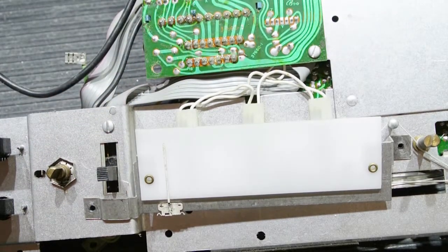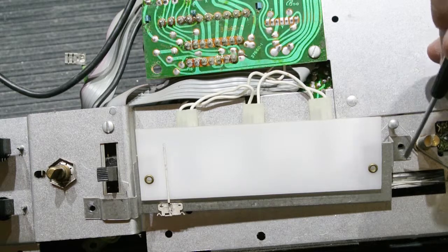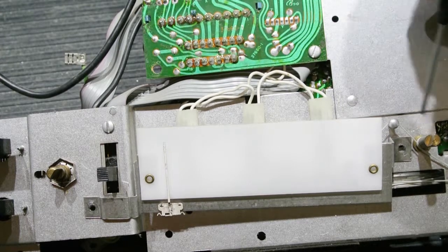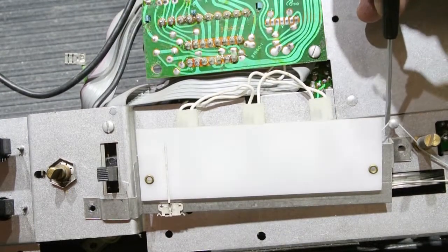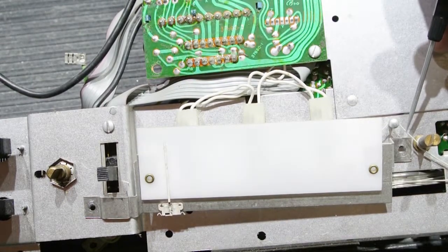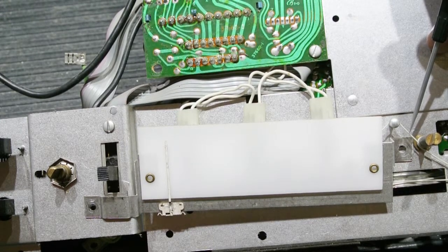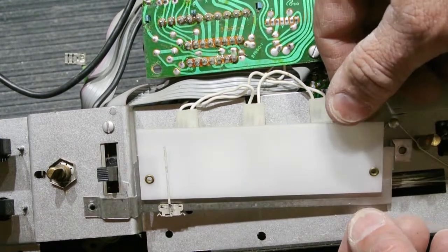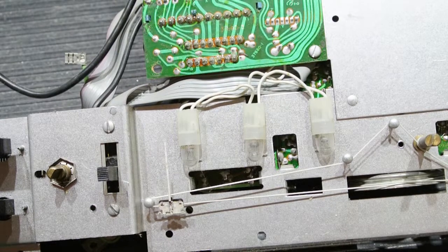Now that we've done that, one thing to be careful of, this part of the metal bracket that holds the diffuser where you took the screw out is right next to the dial cord. The dial cord is what, when you turn the tuning shaft, wraps around the tuning wheel and a variety of little pivot or turning points and moves the pointer back and forth. If you break the dial cord or cut the dial cord accidentally, you've got a real problem. Replacing dial cords is a complete pain in the neck. So here it pays to be a little bit cautious and lift this away from the dial cord as you take it out. All you simply have to do is lift the diffuser out of the way,